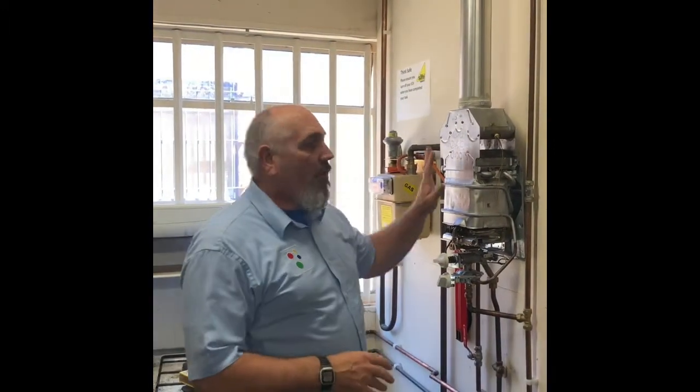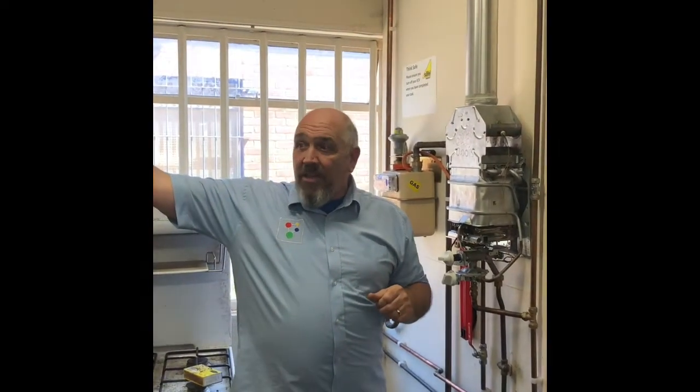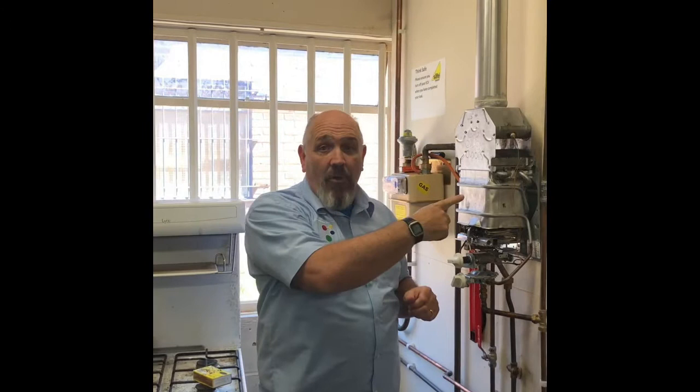So you close the doors and windows, switch the fans on. Passive stack ventilation — has anybody told you about PSV? No. Right, I'll send you something about PSV. Passive stack ventilation: the first test you do with it closed. This is ventilation for the house that you can open and close — not gas ventilation, it's other ventilation. Close it, and now everything's tight as a drum and the gas ventilation is the only place you're getting air from.